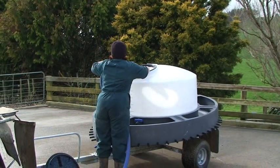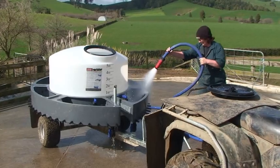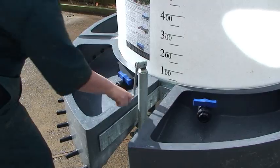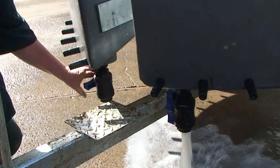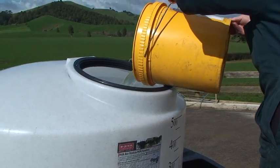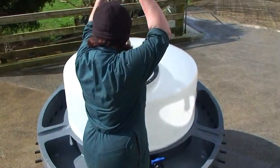Cleaning the Milk Bar 50 Classic is just as easy. Give the tanks and manifolds a rinse with the hose. Use the manual leveller to drop the front of the feeder down so all the water drains through the taps situated at the front of the feeder. A hot wash with an alkali detergent is recommended a few times a week to strip the feeder and teats of milk fat and proteins, and will prolong the life of your teats.